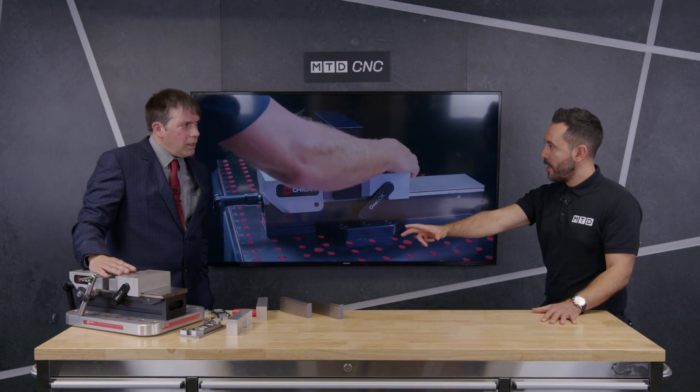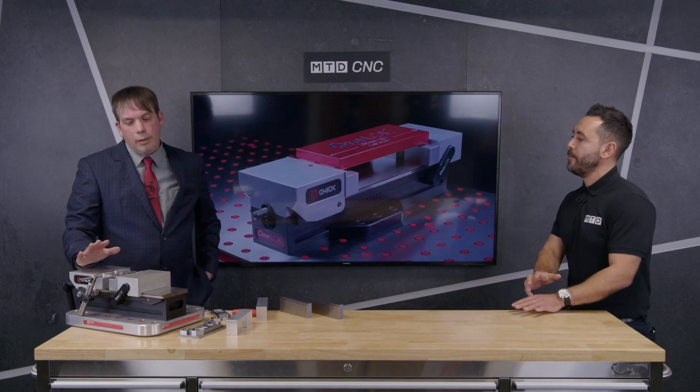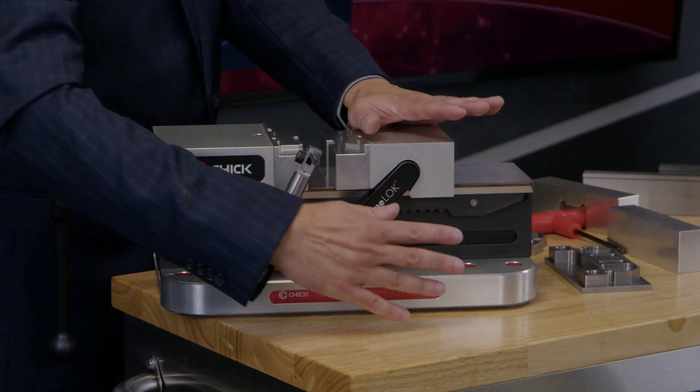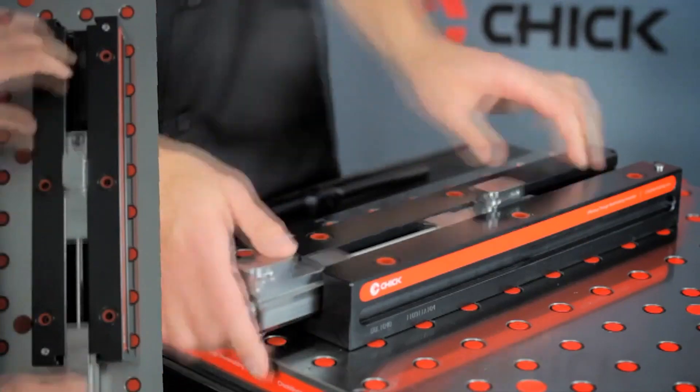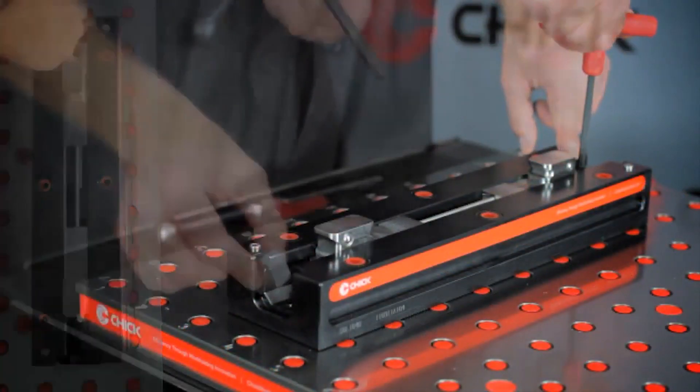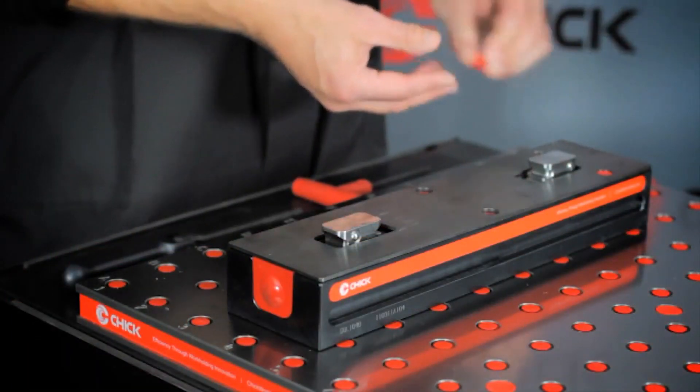It's mounted on a base plate. You have a couple of options for mounting the OneLock. It does have a rail at the bottom to allow you to mount it directly to a normal T-slot table, and Chick supply a toe clamp specially for that purpose. But one thing I really like is matrix tables — Chick have their own one called a Foundation, and it looks like this. When you mount the OneLock to the Foundation underneath, you can see it locates using a round and diamond pin set. There is a special clamp available that is pre-aligned to the holes in the Foundation, so it's very, very quick to mount. It's also quite light. It locates with better than 20 micron precision.